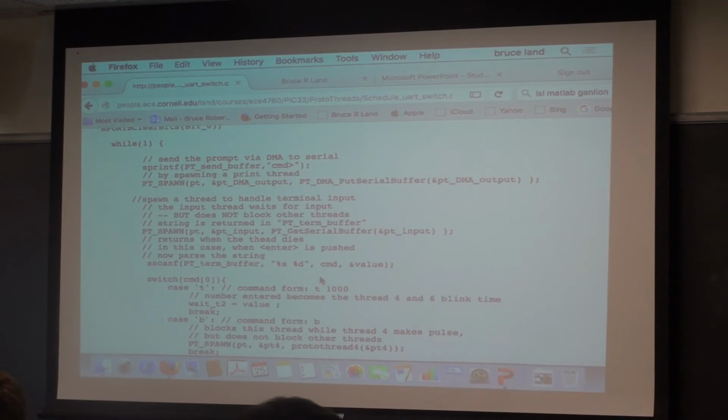So I took the code that I'd had for the non-big board value, plugged in the adapter cable, programmed to change the pin to RPA1 rather, compiled knowing it was going to work, and it didn't. And the reason was that I was blinking an LED using A1. And so that was jamming the UART input. And as soon as I turned that off, then it worked.